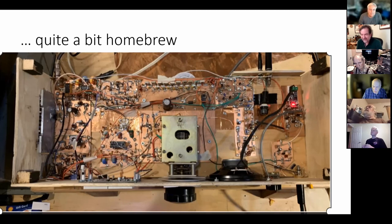I mean, Pete and I have differences of opinion on different things. For example, he's a big fan of the SI-5351. He does not like analog VFOs. He's made that very clear. And what you just mentioned is another area where he's a believer in factory-made crystal filters. I like these kind of crystal filters. Now, it's hard to do. It's harder to do it this way. It's more perilous. You might end up not getting it to work exactly the way you want, but you get better at it over time.